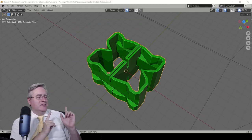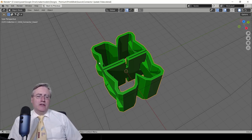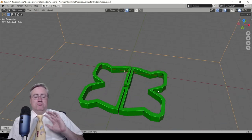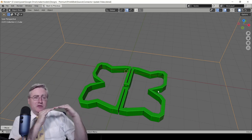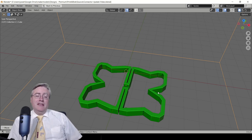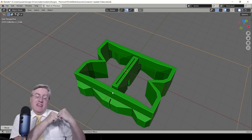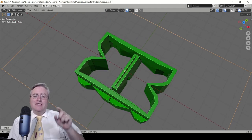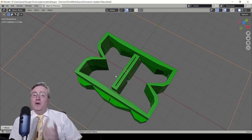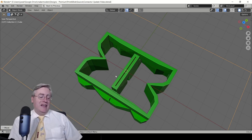What I came up with was a single cut, because we didn't need to do the double cut, but one that kind of zigzags through the print. Let's do some virtual 3D printing using Blender's Boolean modifier. The first couple of layers cut in from the outside, trying to get them to fuse in the middle, and then hopefully the walls fuse together. By the halfway point, the outside walls are now solid, preventing it from accordioning apart, but on the inside there's a little island of wall. I've tested it on Prusa, Cura, and Flashprint — all of them will do this.